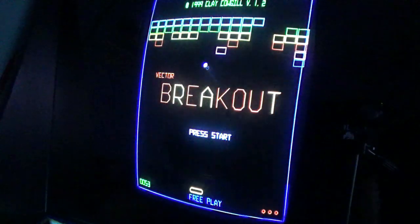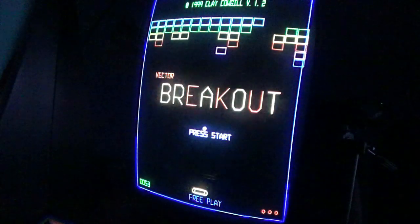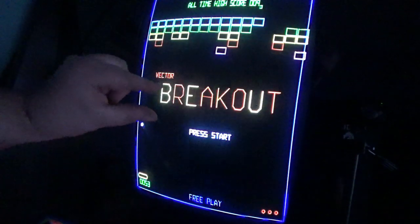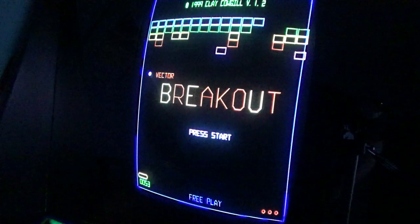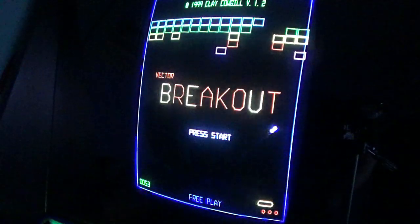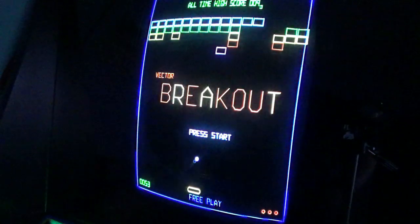That was not the best. Not my greatest. I've gotten 93 on this, I believe. There's a chip on this board called the EAROM, and it was an early flash ROM chip that was on Atari games. Anyways, the EAROM chip is bad on this, and it doesn't save the high score.